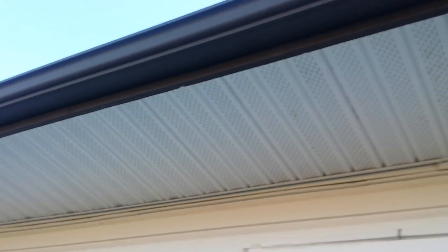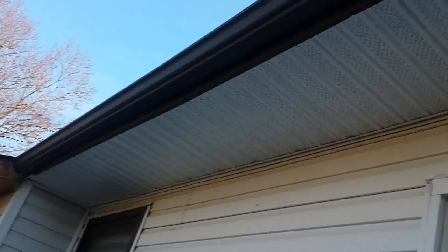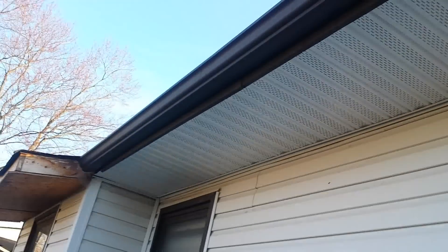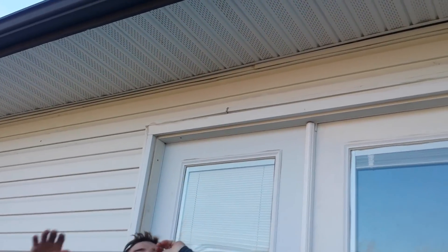That's it guys. I just wanted to show you - I wish I had realized how much easier it was a long time ago and not let it go. I'm going to do that piece of wood there too. There was never a soffit there before - I built that bump out because the house used to let water run down the back of the house and ruin the wall. That's really it. As always, seize the day each and every day. Any questions, ask below. You can also use J-channel here if you want it to look really good up top, but then they won't be screwed in - I wouldn't recommend that.